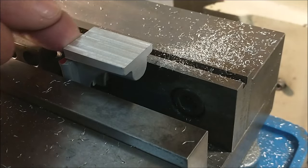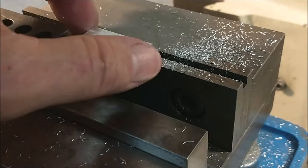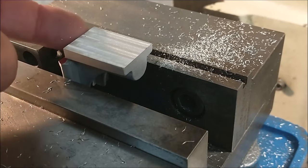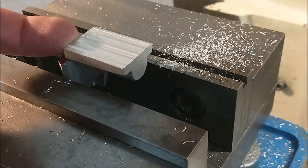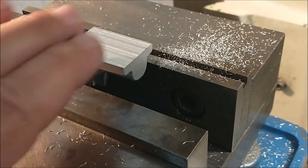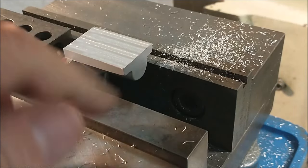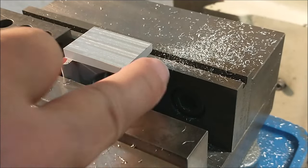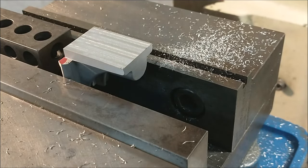I'll have to cut the backside here, and then I'll have five beautiful, nicely machined surfaces to continue the operations from. So let's move the cutter around the backside. Establish a section here where I can flip this up and press it against the back jaw on a parallel against this side and bring this front in, do all the drilling, and feel more confident about the grip.